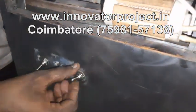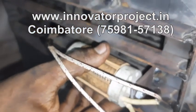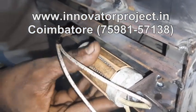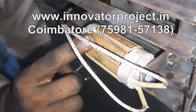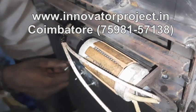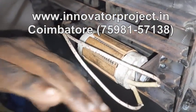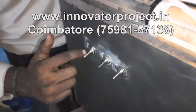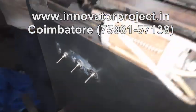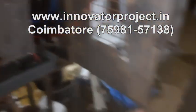Then there is the heater — this is the heater — the heat will be heating up. So it will be heating; wait for some time. After that, put on the blow air so that hot air will be coming. The heater is heating up and smoke may come initially. Don't turn on the pump in hot air mode. Air heater uses blow air and heater switches together; air cooler uses blow air and pump switches together. So this is the solar channel auto-tracking with air cooler and heater.